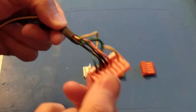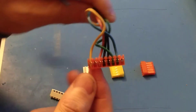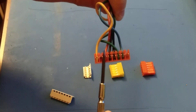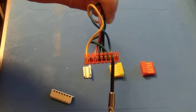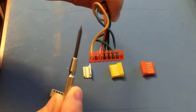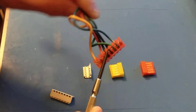The idea is to be able to terminate these wires into the actual connector. They're user-assemblable. The way they work is these metal pins that make contact with the different male headers have a V-groove, and they cut into the insulation of the actual wire. So there's no need to strip, solder, or do anything special.